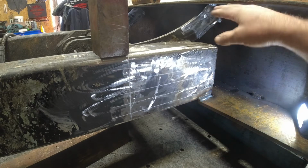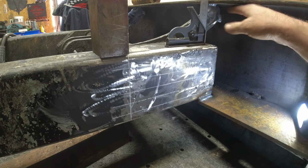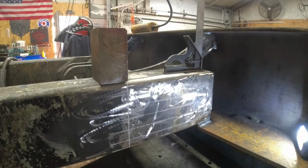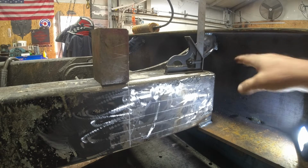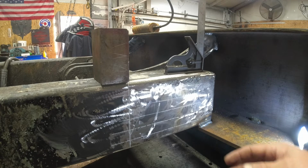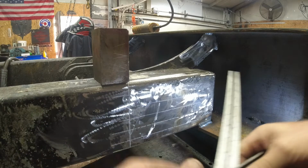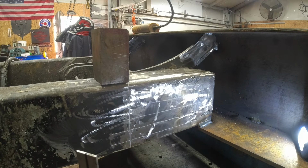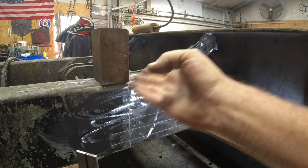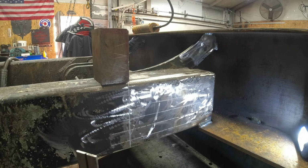And then I laid it all out, and then I measured from the back of the blade to here with my square to get this distance, and then I kind of guesstimated the slope of this. This part here is a little higher in here, so I just added maybe like a 1/16 or so, running off of the square. That's what I moved that for. I basically held this on there like that, and I got the gap that was in the far back side, measured that, and then just added a little bit. So this is tapered a little bit, and then I'll have a little slope here. It's not going to come down straight. It's going to taper or arc like this piece is. So I'll take you over here and kind of show you what I drew.